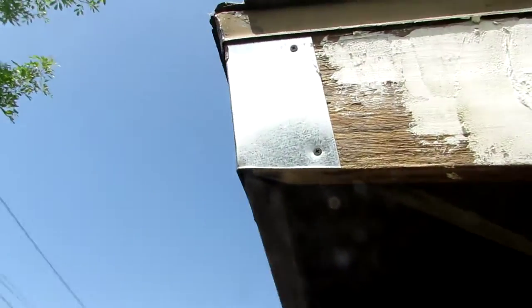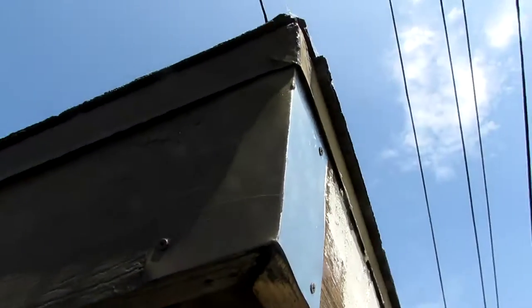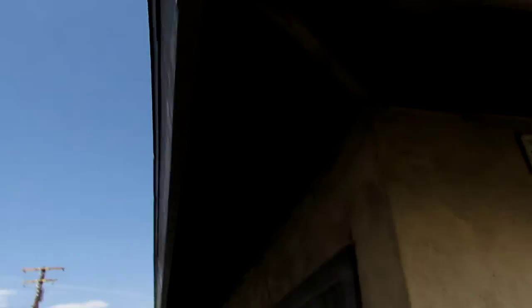One other two tips. When I had the two corner fascia boards, the corners were really rough. So here's what I came up with for the corner — it's like four-inch flashing that I just cut with sheet metal cutters, and four drywall screws. Put some paint on it, get a great corner — looks dope.